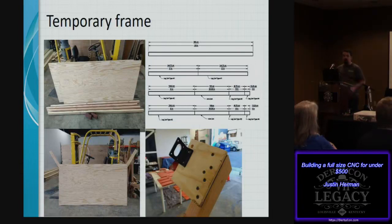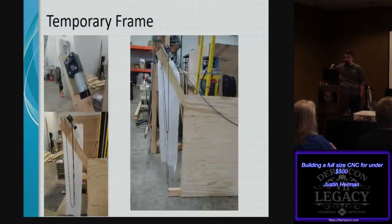We then mount them on the plywood on the rear side with just basic screws, letting them stick out at approximately 45 degrees, and then mount an additional piece of plywood on the side of one of the arms, and then put a mount on there. At that point, we've got an odd-looking configuration that looks somewhat like the original product we were looking to get to, but we move forward with putting on the motors, applying a chain, and we leverage elastic cord, which keeps tension on the rear of the chain.